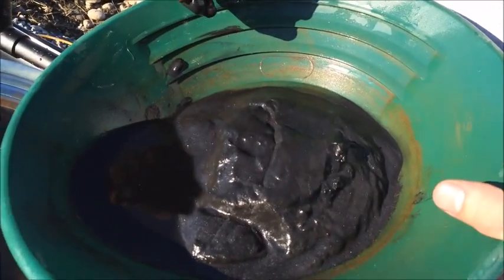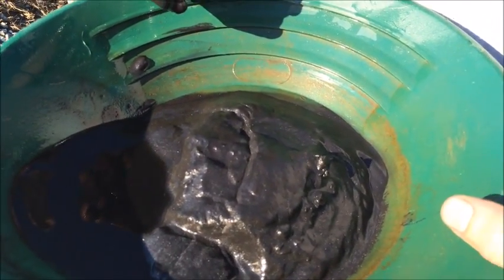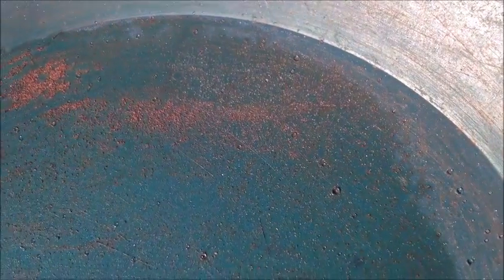We've panned out the middlings concentrates hole now, and there is a little crescent in the crease of the pan. Typically that's about 5% of the total gold that comes off the table, with the rest in the high grade hole. Now we've got a big glob of the tailings — I expect most of this is ash. We panned about a third of the tailings and there's just a very, very light dusting of fine gold wire off the chips. That's way less than 1% of the total gold recovered by the table. So the table did a really good job of recovery.